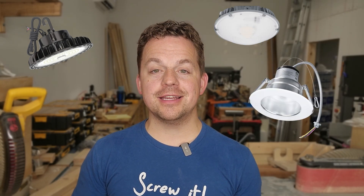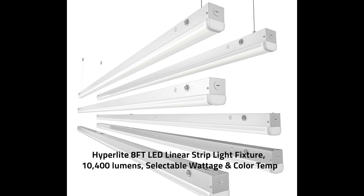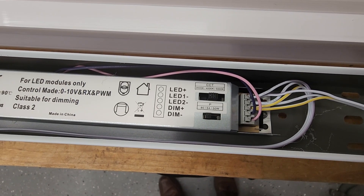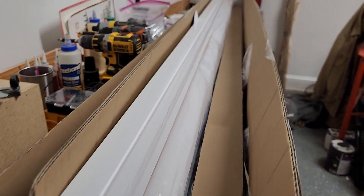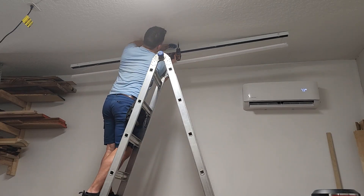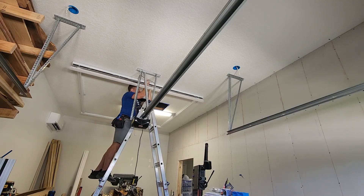With all this info, let me tell you what I decided on and why. I looked at high bay lights, round shop lights, can lights, linear strip lights, panel lights, and hexagon lights. I finally decided on the Hyper Light eight foot long linear strip lights because they meet most of my requirements: 10,000 lumens, adjustable color between 3,000 and 5,000 K, adjustable wattage to reduce brightness, ceiling mountable, and most importantly a diffuser lens so it doesn't hurt your eyes. The lighting analysis recommended four of these lights for 40,000 lumens, but their location would have put the light behind me at the workbench. So based on my desire to have things really bright without shadows, I decided to go with four lights around the perimeter 24 inches off the wall, and three lights down the center on two different switches. This gives me 70,000 lumens total, with lighting directly above my workbench as well as overall lighting from many angles to reduce shadows. I set the color temperature to 4,000 Kelvin, but I can change it later if needed.